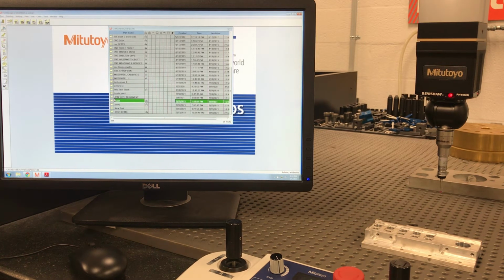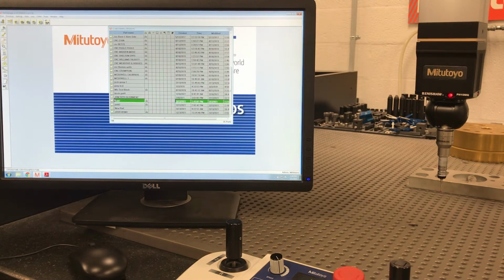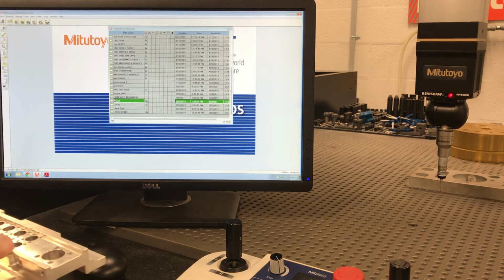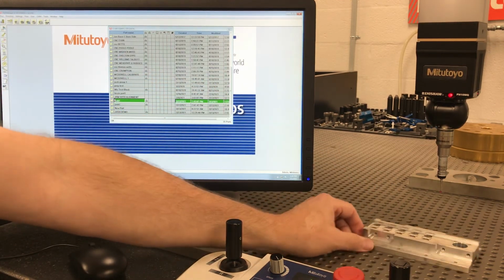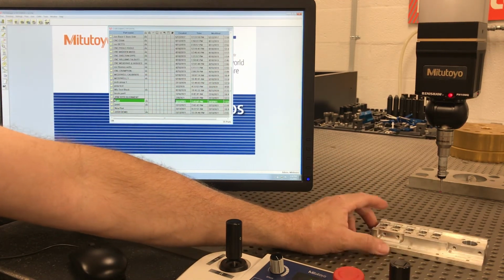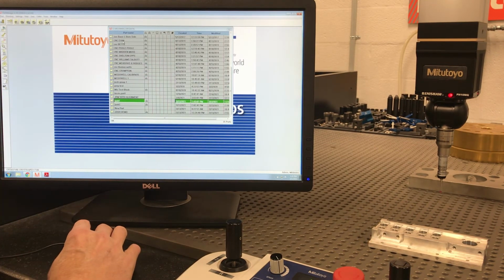Now, we come back 4 months from now, 3 months from now, we're taking the same part over. We come in and we're like, you know what? I got a program in there somewhere for this part. Of course, it wouldn't be called junk. It'd be called drawing 3861. Put it on there. I don't even care if it's straight. Just put it on there. Find the program in here, whatever one it is. And this one's junk 1. Then we go in here to repeat.